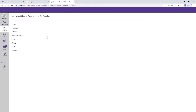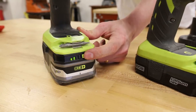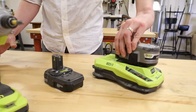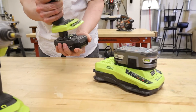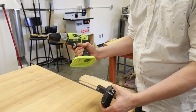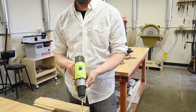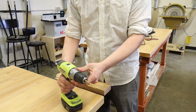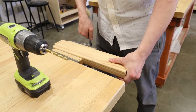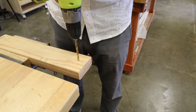The standard operating procedures for a power drill are as follows. If the battery is low, do not continue using it — charge it and replace with a charged battery. De-energize the tool by removing the battery and inspecting it for damage before use. Make sure to have the workpiece secured properly to a stable work surface with a clamp or vise.